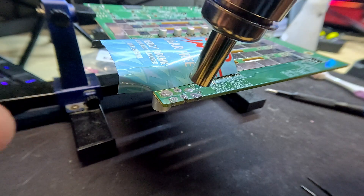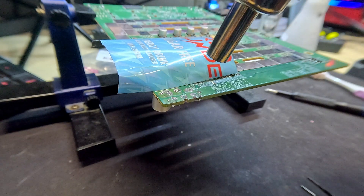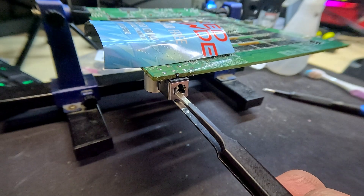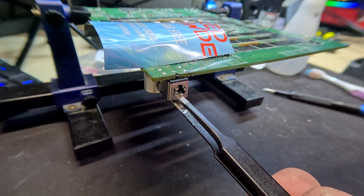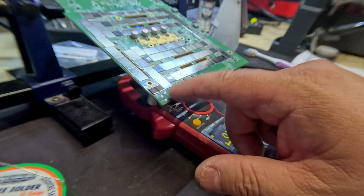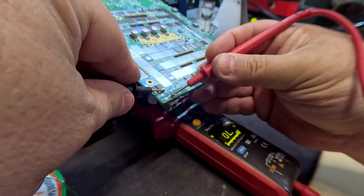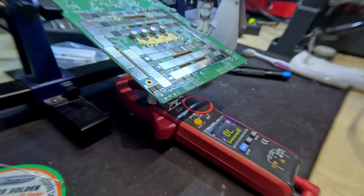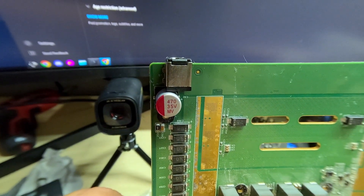You can just start seeing it turn to metal now because we've finally heated the PCB enough for that low-temp solder to start melting — so we're probably about a third of the way there. There we go — it melted. We are seated. Got to hold it here for a few seconds just to make sure it re-solidifies correctly. There we go. Cleaned up the solder job and got rid of any little solder balls from the low-temp solder paste. Let's double-check before we put it all together that there's no short between positive and ground. Nope, we're good — no beep. Let's look at the other side: there's the new connector, perfectly clean. I think we're ready for reassembly.